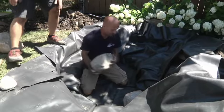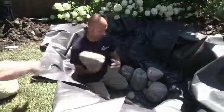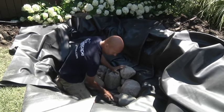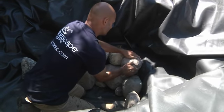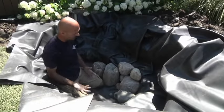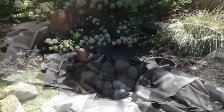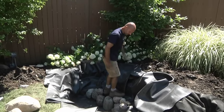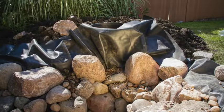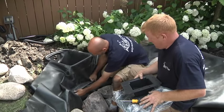Once the liner is set in place, you can begin to rock in the pond by placing boulders along the vertical walls of the pond floor. Start at the bottom and use a variety of sizes of stone as you stack rocks in the pond, much like building a stone retaining wall. If a boulder doesn't fit, flip it, turn it, and twist it in place — and if it still doesn't fit, set it aside and try a different one that will lock in place. Be sure the tops of the stacked boulders sit higher than the vertical walls in order to retain the gravel on the shelves. Continue to work your way up from the bottom, making sure the stone walls are stable as you go. Consider the waterfall while rocking in the pond and use larger stones to frame out a waterfall entry point into the pond. Before you can finish rocking in the pond, you'll have to hook up the skimmer.